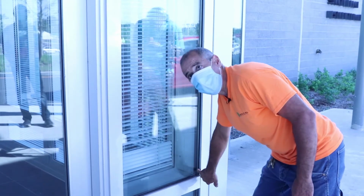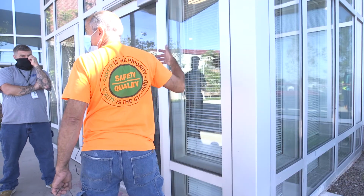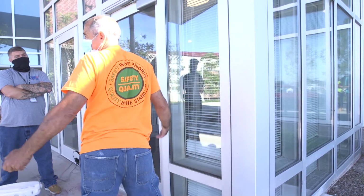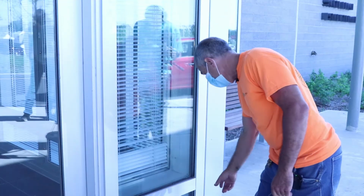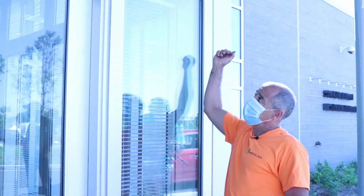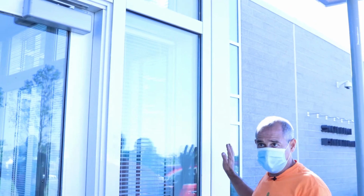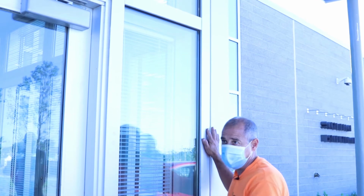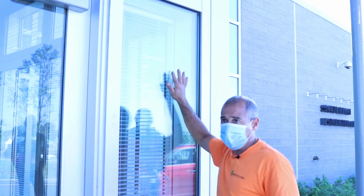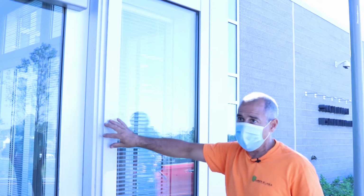You get a bar in here, you get underneath that rubber. I would always start at the end, top or bottom. Don't start in the middle, you'll fight it for a long time. I don't know if you guys will ever be doing this kind of glass replacement, but the procedure is these come off. The window is glazed to the aluminum tube system on the back side. These windows are fixed and glazed to. There are no screws holding on pressure bars or unit caps.